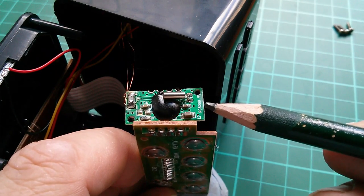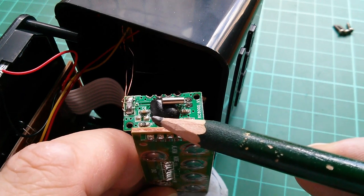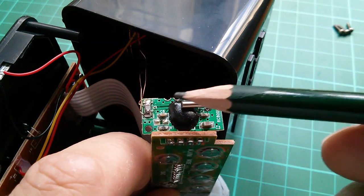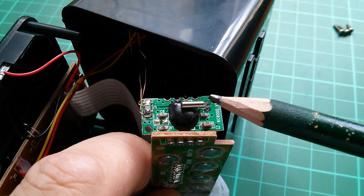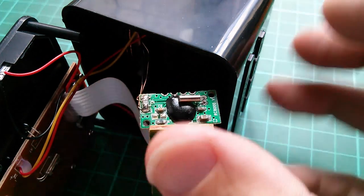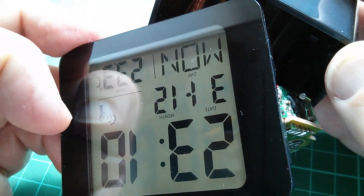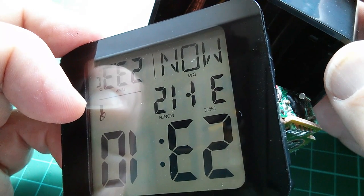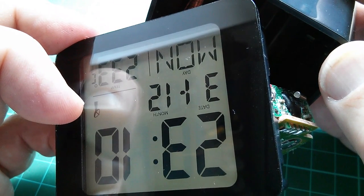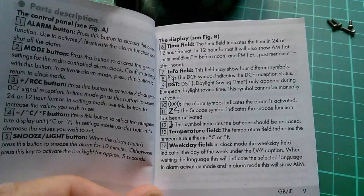Here is the switch board with a load of switches and also the radio board. The enamel copper wire from the coil is wired across a capacitor; there's a little crystal, a chip, and some resistors and capacitors. It's named RC8000V1. There's the crystal, the chip, a few resistors and capacitors, and the enamel copper wires are soldered across C1, the capacitor up here. If I'm going to add an antenna, I'd solder it to one end of this coil.